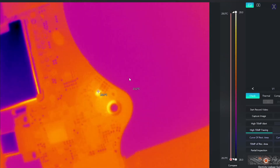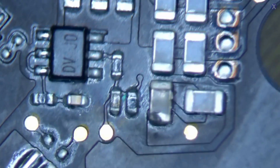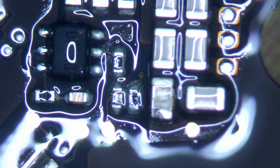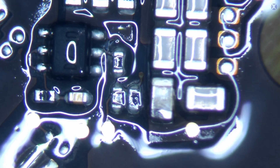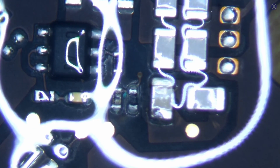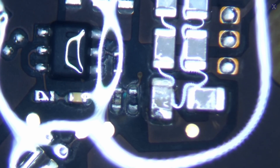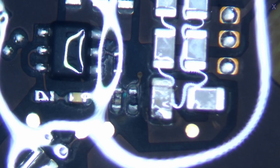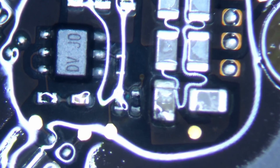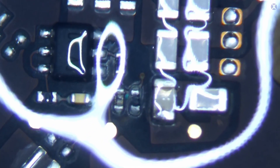Most likely it's a cap giving the issue. The CD32 is also flickering a bit — the little square on the left. We can see the culprit: it's just a capacitor, pretty close to where you plug in the USB-C charging. And here's an old-school method if you don't have a thermal cam — we're using alcohol. With it plugged in, you can actually see it pulsing, which does the same thing as the thermal cam: it shows voltage going through and indicates a short. You can also feel with your hand if it gets warm.